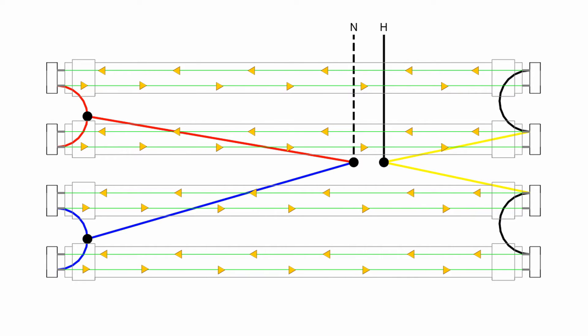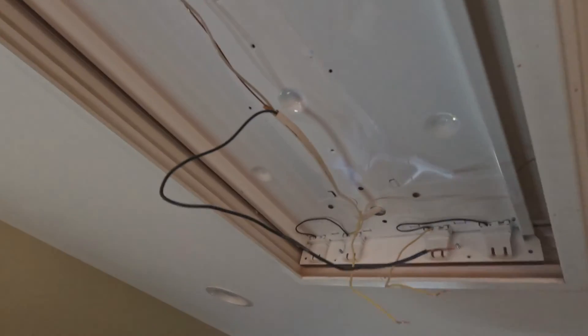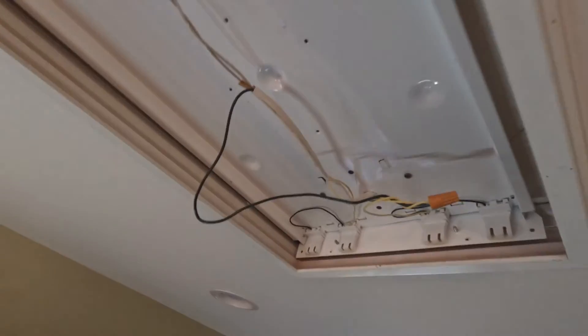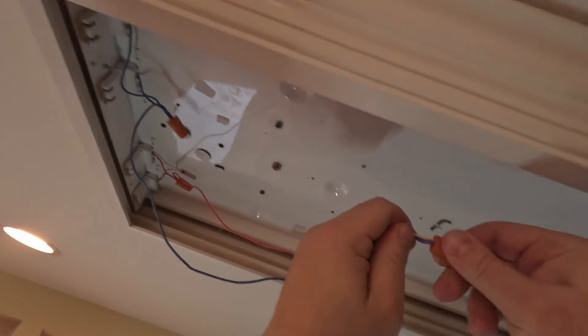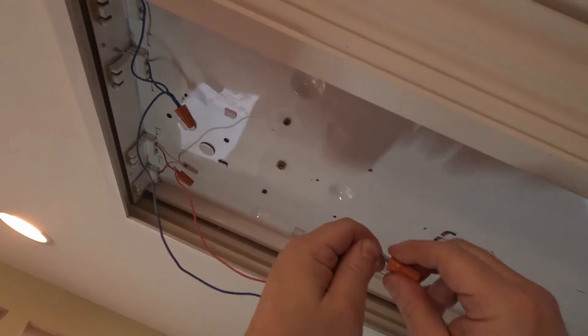What would you have done — would you have done it this way like I'm doing now, or would you have done it like my original plan and just wired one side? Sorry for the poor camera work here, I am new to this. I tape off the hot just for peace of mind, and then I wire in the neutrals as planned. As a DIYer I should probably invest in some Wago nuts, but I've been using wire nuts for years and I haven't burned a house down yet — at least not one they can prove.